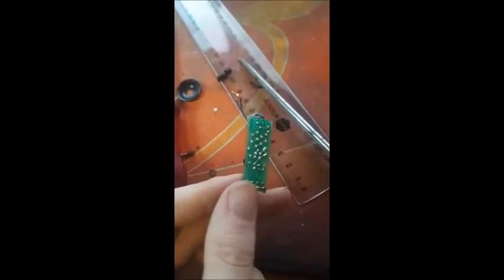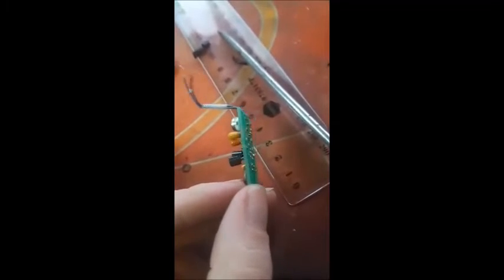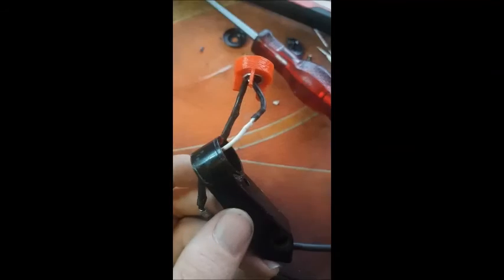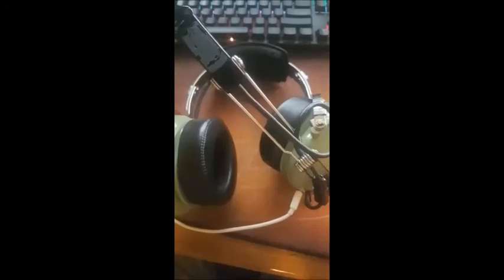Got to pull this guy apart. This is what's on the inside - chances are the capacitors need replacing but I'm just going to bypass all of it. The mic is hooked up and about to put it in and remount it. I 3D printed the adapter, fitted the mic in, got the little seat so it doesn't go too far in and bottom out, got all cables lined up, plugged in, things wired up. I should have it playing from the PC - testing one.